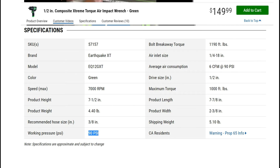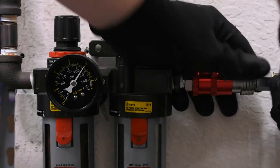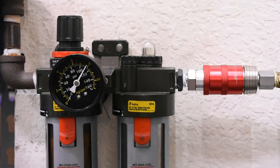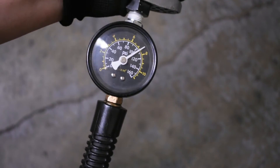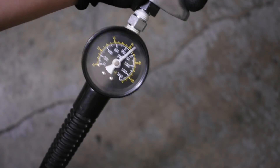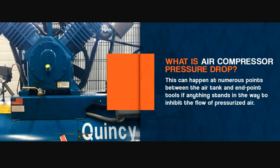Before we talk about what this process will be, let's talk about air pressure. The tests we've been discussing are at 90 PSI dynamic pressure in the tool while it's running. So you may be thinking that's like 95 to 100 PSI at the wall — but look: this is with high-flow fittings and a 25-foot hose. The wall's set to 112 PSI, which should be plenty, and only drops to 100 PSI at the wall. But look at the tool while it's running — this is around 78 PSI. So you need a much higher static pressure to get to 90 PSI in the tool.